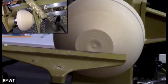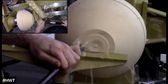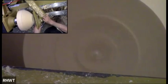So this one, shoulders produces a nice big chip. So you can see across, I'm a tiny bit low. It's just a little bit stiff. There we go. Get the height. So you can see very different animal. It still can remove a lot of volume. Now, would I have bothered finishing the bowl there at this stage? No, I'm just getting rid of material so it doesn't tear out the side grain.